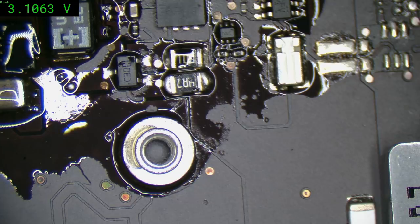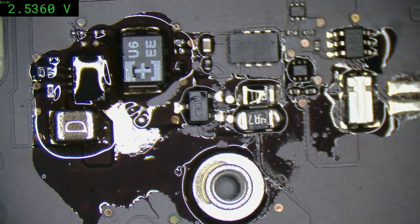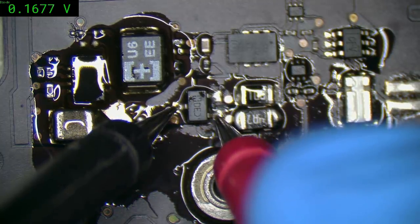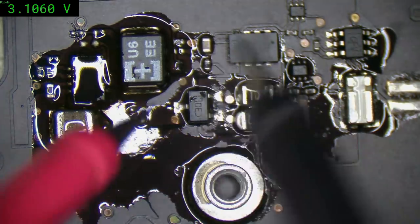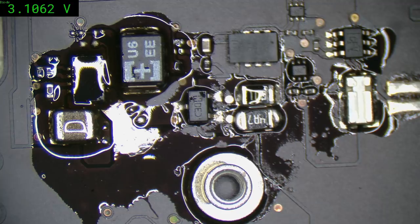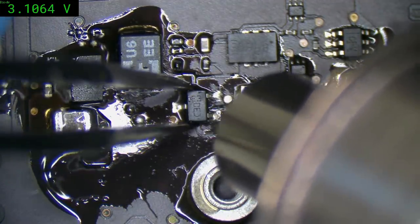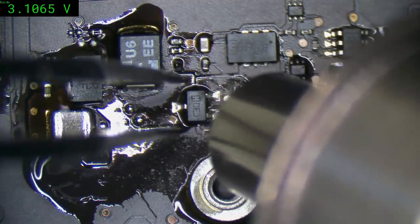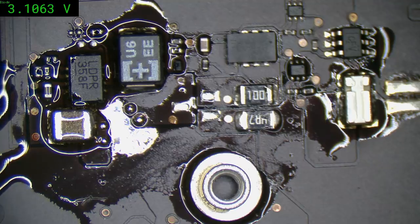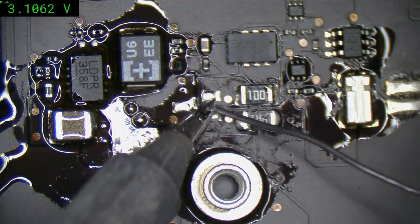One thing I do need to check is the diode mode of that two input diode. 1.9, 0.16. Yeah. I think I'm going to replace that diode as well. Mostly because if there was a short there with the caps and it drew an excessive current through the diode, then it could have been damaged. And since we're already in the process of doing all this work, no harm in doing a little more. Within reason. After all this, we'll probably find out the regulator's blown anyway.